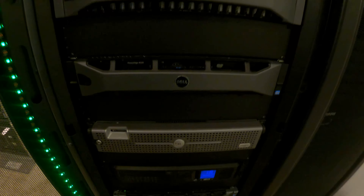If you're going to do something like this, please make sure you have the correct buses and power ratings. This power panel is rated for 50 amps, fed off the main — it's not on the house breaker, it's on the main lug outside which is my 200 amp service. This goes to the 50 amp sub, and behind the wall everything is technically 30 amps currently. Amperage-wise my load balance is right where it needs to be — once I get the electrical wired up top it'll make a night-and-day difference.